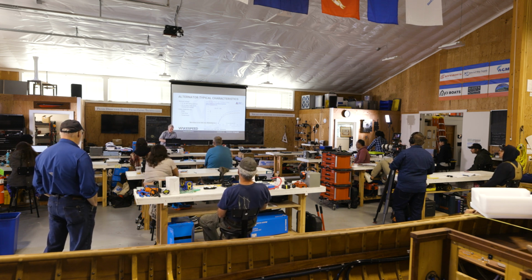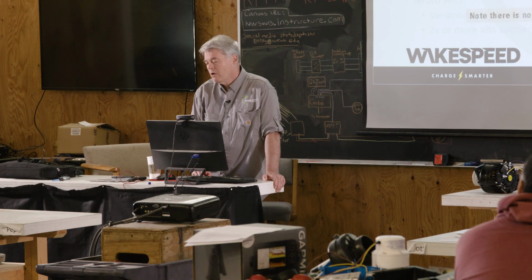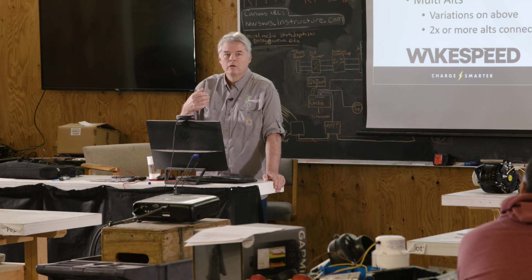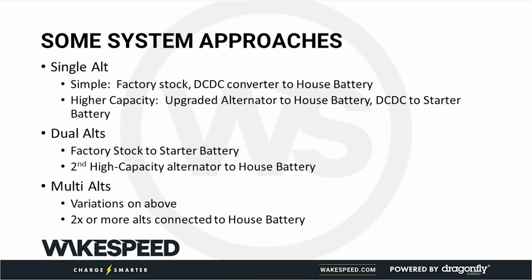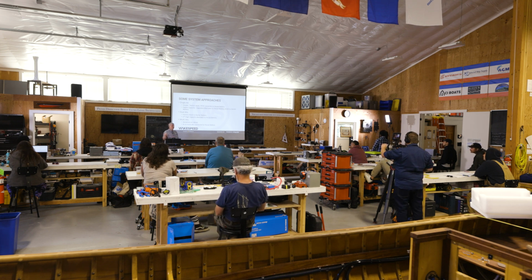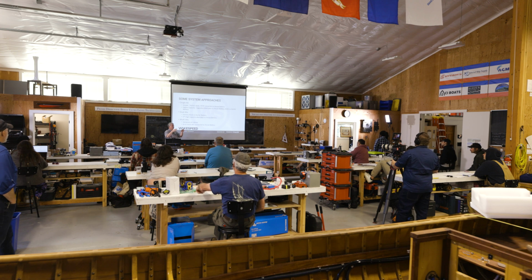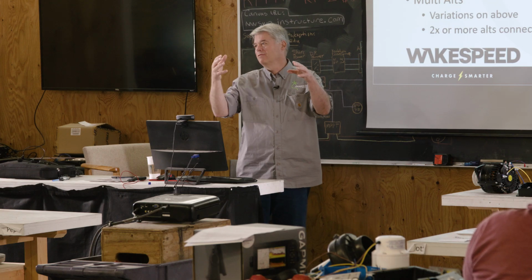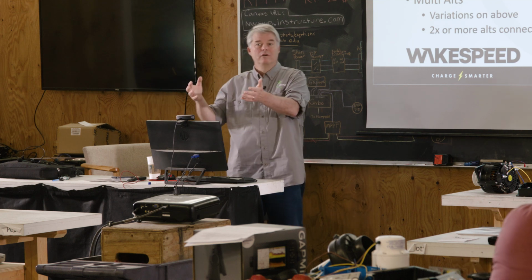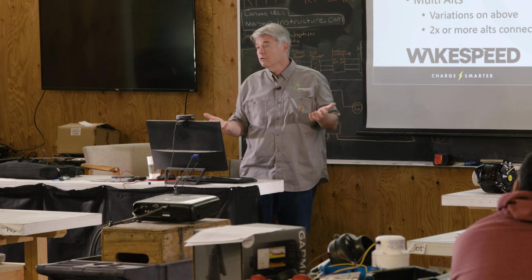All right. We're going to come back to alternators as we go through this, because that's obviously an important part of this, but I just wanted to make sure we covered a lot of the basics. I want to talk about some of the systems approaches. You're going to hear us over the next day or two talking about these high energy systems. And you know what? It's not for everyone. There are a bazillion ways to hook up a boat. If you go way, way back, you had the starter battery and a diode-based splitter and the house battery, and maybe it was a couple of Group 31s or a couple of golf cart batteries. Those are perfectly fine if it satisfies the needs of the customers, right?